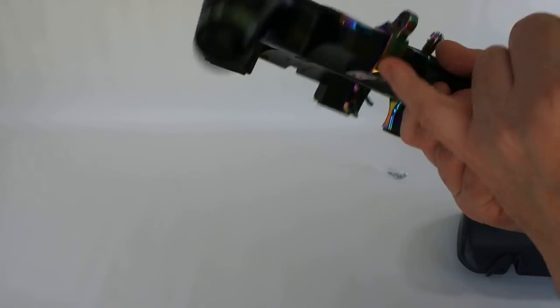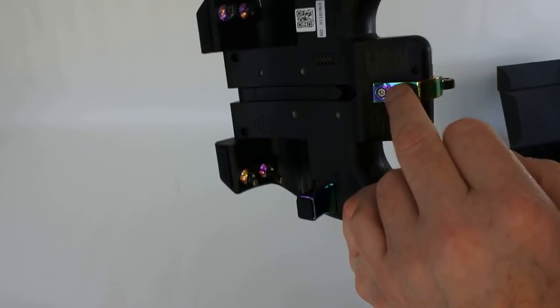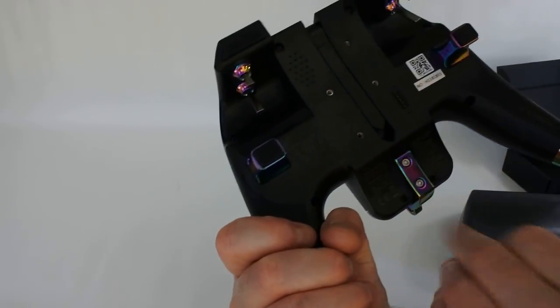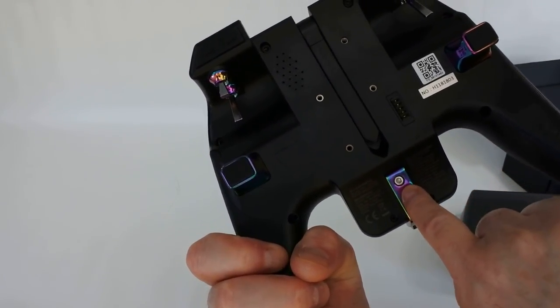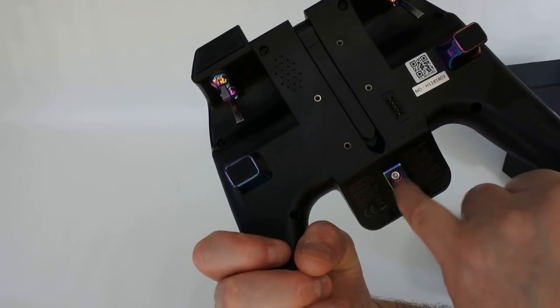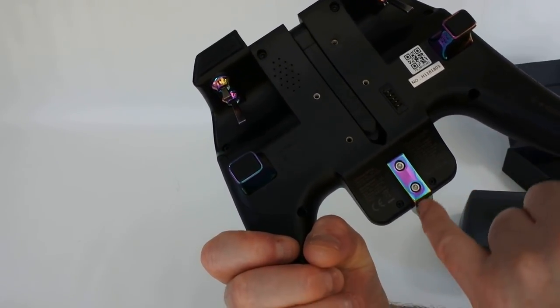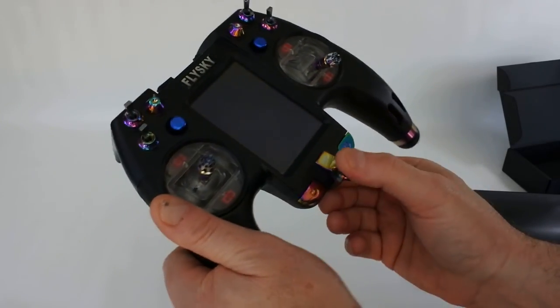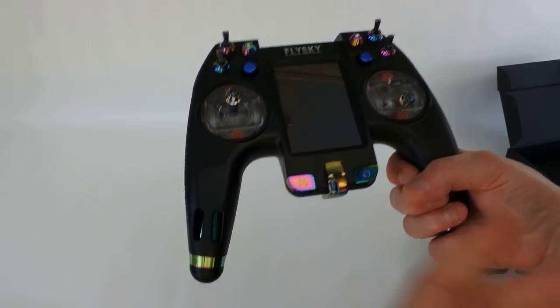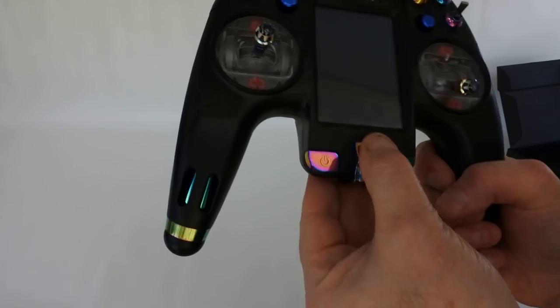One thing I should show you straight away: this is your bracket to hold your lanyard, but there's two screws on there. If you need to get into DFU mode, there's a button inside the hole behind the screw. To enter DFU mode you've got to take this off and press that button. Also the SD card is mounted underneath here, so you need to do that to set it up. If you want to do a software update, you must take this off.